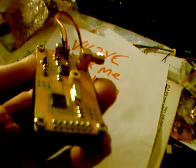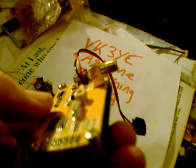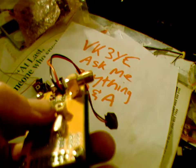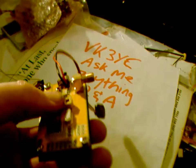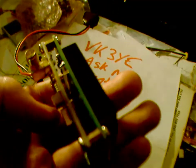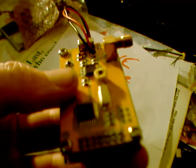So yeah, it looks like I can easily get to one of the connections in the trimmer. The other is a little bit harder, but if you're quick, you might just be able to make a soldered connection without melting the trimmer. Maybe if you had a bit of tin copper wire and pliers and you had the soldering iron on it, so only a little bit of the surface was touching, you might be able to get a solder join there. It's too thin, too little clearance to put the soldering tip down there. So yeah, maybe I'll look into that.